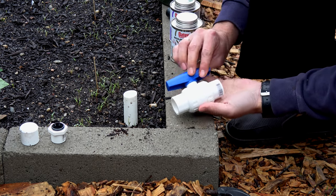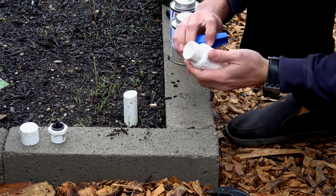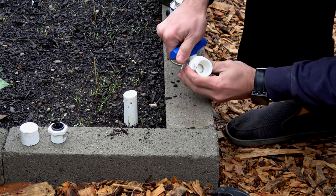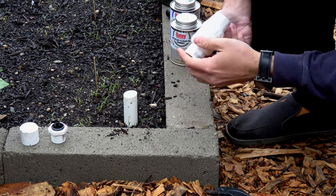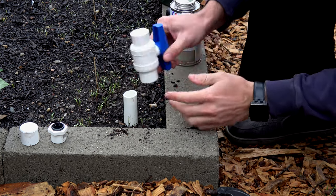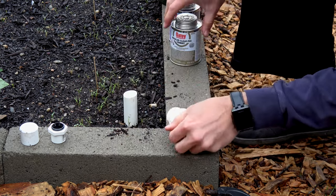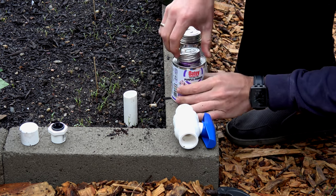some of these valves, they do have direction. This is a ball valve, it shouldn't really matter. It kind of closes the same way from both ends. There's a little ball with a channel in it, so when you turn it a quarter turn, it's closed. So I do not really care in which way this is put, so I'm just going to place it like this. And to do that, as I said, we take some of our purple primer